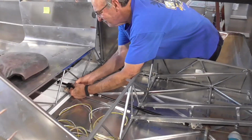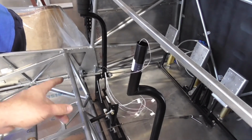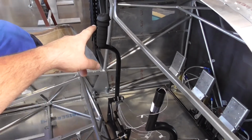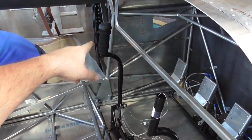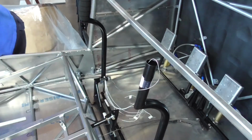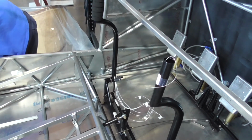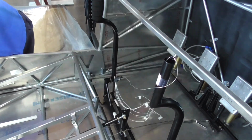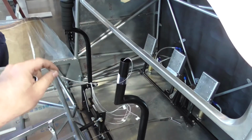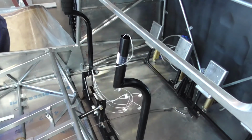So, it's pretty cool. And I got the wires ran for the trim servo. Got the buttons attached, everything soldered, all the wires ran down through the tube. Got them all labeled. Push to talk and trim servo up and down, then an extra 2 buttons for something, whatever we want them to be for. So once we get the one in for this side, I'll pull the wires through with this wire, tape it on, pull them through, and then attach it to the relay.